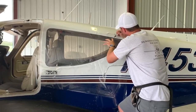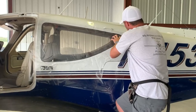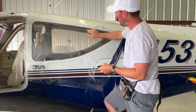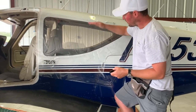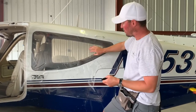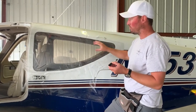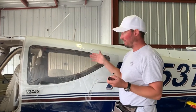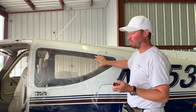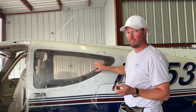This film is totally different from any automotive film. Automotive film is stiff, so you have to apply heat to work out the 'fingers' — the little wrinkles at curved edges — shrinking them to form-fit the window with a heat gun. But heat makes automotive film curve up, so when you pull the airplane out into the sun, the heat grabs that film, twists it, and that's why you hear horror stories about car tint destroying airplane windows. Our aviation film relaxes in sunlight, which is really cool.